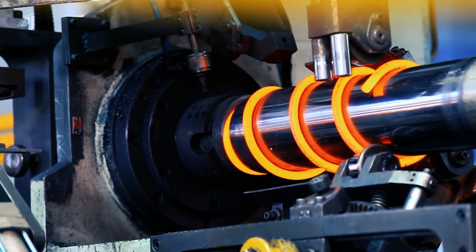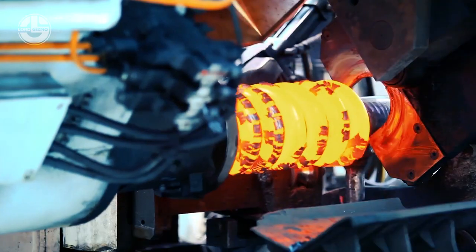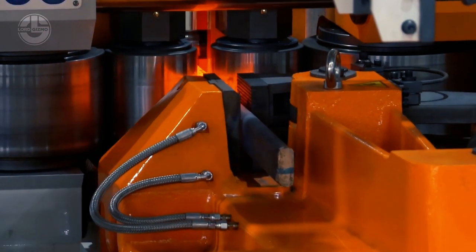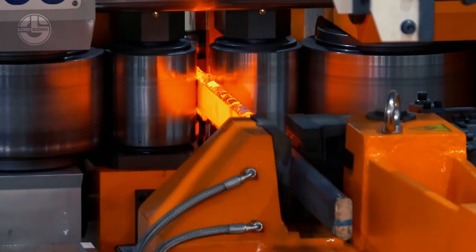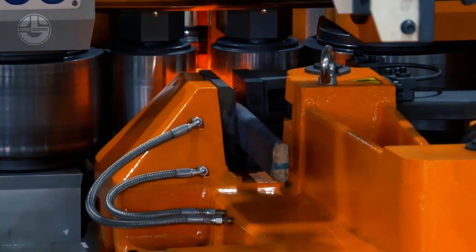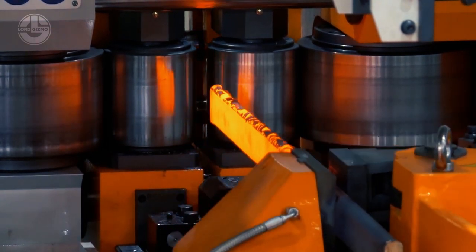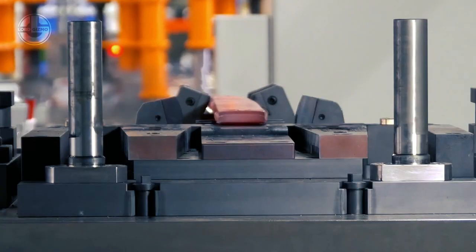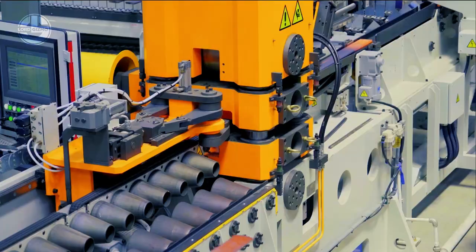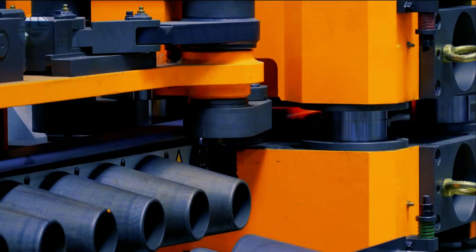The spring is then placed in a quenching oil tank to cool, which improves the spring's strength. It then moves through a tempering process that further enhances the metallic strength. The manufactured spring has to pass several quality tests. Scragging is one of these procedures. In this process, the spring is completely compressed to see how much it can sag and how much height it loses. Then it is powder coated to make a strong protective surface. Finally, the spring is labeled and put in a box to be shipped.